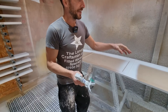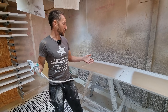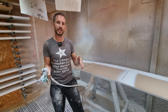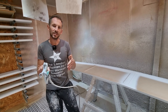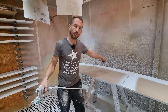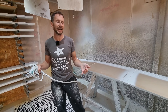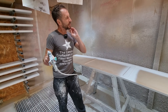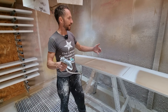When we do make shaker style doors, if anyone makes them the traditional style where a panel slots into a groove, you're most likely going to get a little line in between. It's quite hard to get rid of that line, especially when you're spraying — the spray doesn't want to go into that gap and doesn't want to fill those gaps. So you really want to just try and get it in quite heavy, at least for the airless sprayer, to try and fill those gaps.